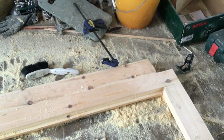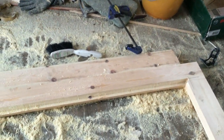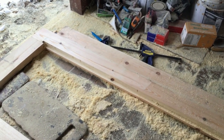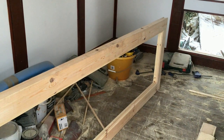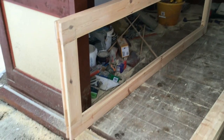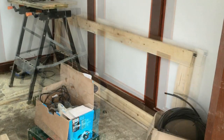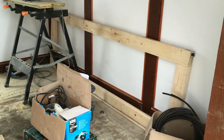I've cut down with the router on the inside of the door and it's 27mm deep. The glass will lay on that edge and then it'll be sandwiched down with 10mm square strip wood — and with that strip wood I'll be creating the shoji. So there we go — another finished frame for the shoji doors. That's two frames made now. All I've got to do now is to make the shoji inserts.